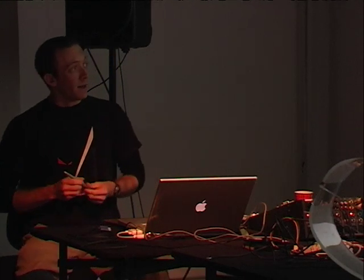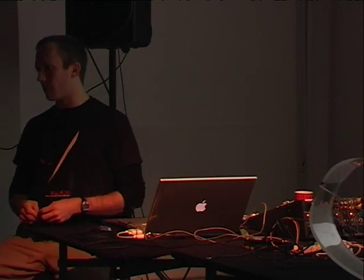User-friendly interfaces. One of the things that we pioneered with micro-OSC is that we use normalized representations of numbers that make more sense. For example, we use IEEE floating point as a representation for analog input values. The nice thing about these is that they're bit depth independent, so I can switch out one micro-OSC board with another, where one might have a 10-bit A to D and the other a 12-bit. It doesn't matter to the end user, because they all just show up as numbers scaled from 0 to 1. So basically, we implement this conversion directly on the microcontroller. There are also different sorts of ratiometric units, and I'll talk more about that later, as well as standard SI units, like ohms, farads and amperes, which are the actual scientific units for what's going on in the sensor.